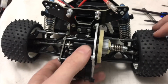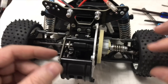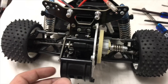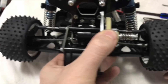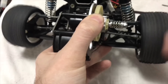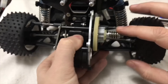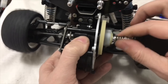That was a bit of a mission — non-stop on Messenger to my buddy Lee. Eventually got to the bottom of it; I was doing it the wrong way around and was actually just locking it up, which wasn't achieving anything. So we've got it adjusted now. If I hold the spur gear, it's much tighter — not fully locked, but not as free. And if I hold the left wheel down and the spur gear, instead of slipping it now turns the wheel. So now I've slackened the clutch off.